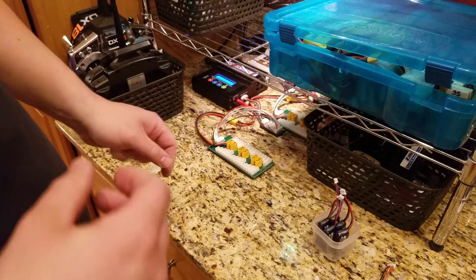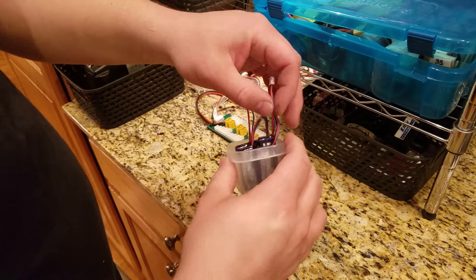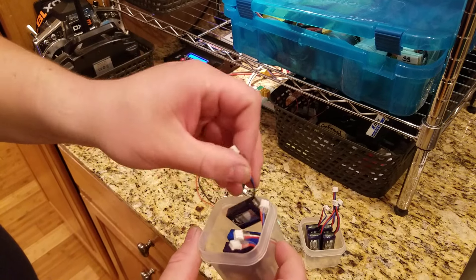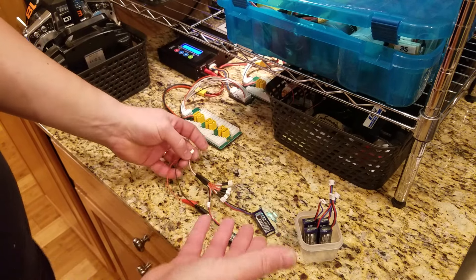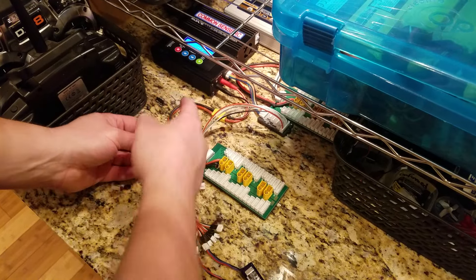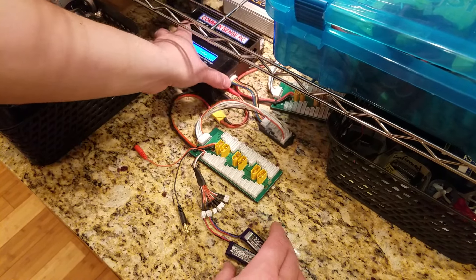I'll show you how I'm going to use this to charge up to six of these in parallel. The way this works is you can balance charge these batteries — you'll just plug each of them in. I get these from Hobby King, they're really good value, they work really nice, probably on par with your E-Flite packs. You can charge different sizes, but it's nice if you have the same size — you just total up the milliamp hours for each of the batteries. You'll want to keep these leads separated from one another, and those would plug into your balance charge port or regular port on your charger. I'm going to put an XT60 on this so I can use my balance charger to charge multiple batteries.